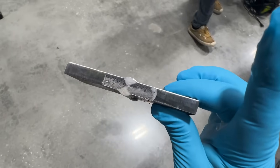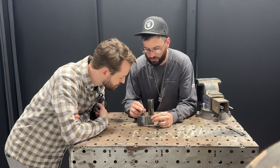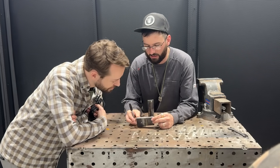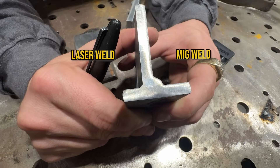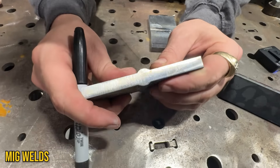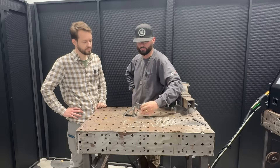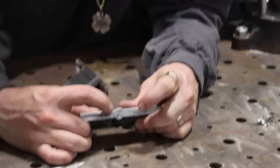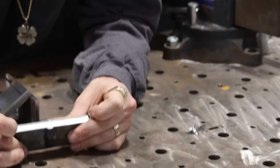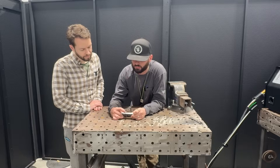We got a little bit more clarity on the MIG welding than we did the laser, but I think we got enough to see. We might have to mark things out with markers so you guys can see on camera. Looking at the cut and etch, I think we saw the results we were talking about earlier in theory. I did turn up those volts and amps on that MIG machine and we got pretty good results — really deep fusion, nice and wide, and you can see we're punching into the depth of the root. We're still not quite getting each weld nugget to achieve complete joint penetration.